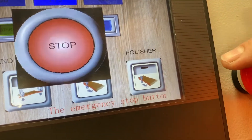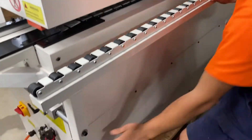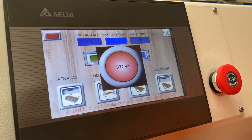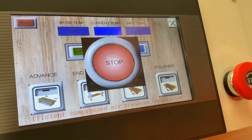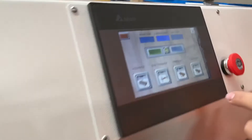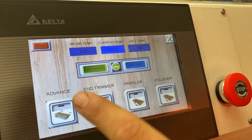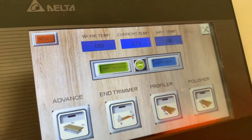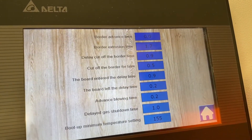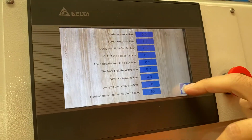If you disconnect your air it'll do the same thing. So air is being disconnected and you can see it says 'insufficient compressed air,' and it'll keep doing that until we plug the air back in — then that'll disappear and clear the alarm. You can also push this reset button to clear the alarm; if it doesn't clear, you still have that active alarm. Up the top here we've got settings — you don't need to adjust these. This is timing of the adjustments in the machine, the guillotines and that, but they're set from the factory.